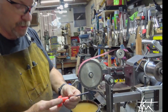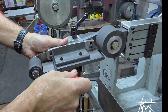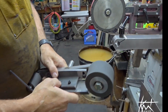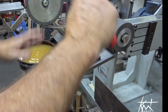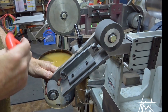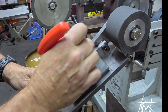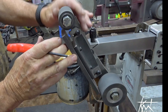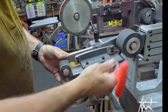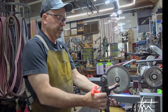These are three-sixteenths allen heads. These slots mean when you loosen them they'll fall right out, so the first thing you want to do is mount your platen on your grinder tooling arm, tighten it down a little bit, and make sure everything's loose. As they come, this part is called the platen face holder. You see these washers right here - these are an absolutely necessary part of this assembly. They space the platen to the correct distance so it's centered on the wheels. Make sure if you pull these socket head bolts out that you replace these washers, otherwise your platen will be off.